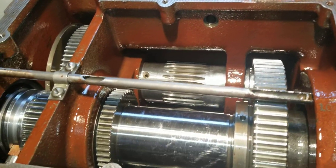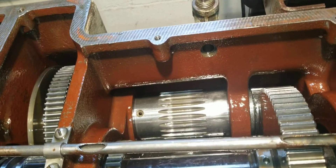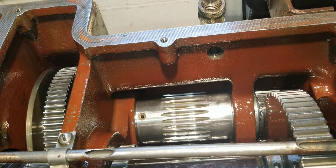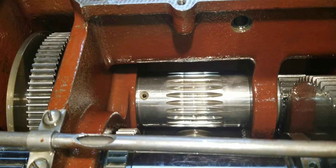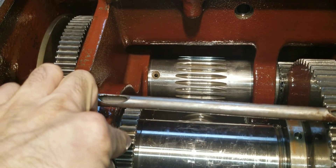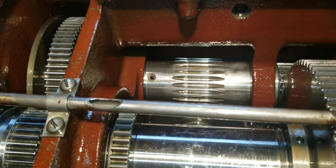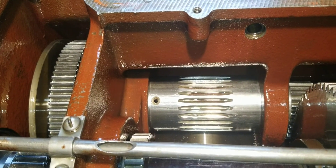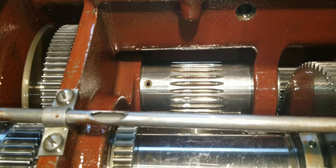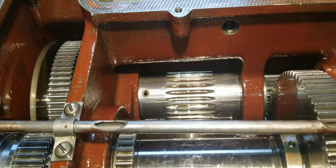I think it's a design flaw because like I said, that's the only time it gets oil. But it actually has two holes in it - it has that one there, which is the hole that's pointing to get oil on it from this gear in back here, which it won't get. And then you've got this hole here which will actually be for direct drive - the oil will go in that hole in direct drive.